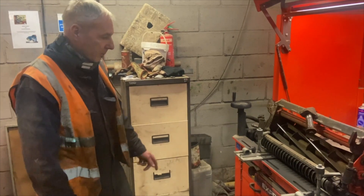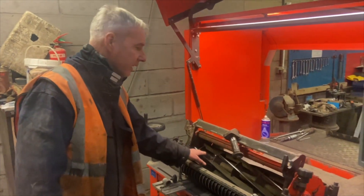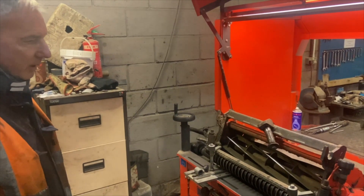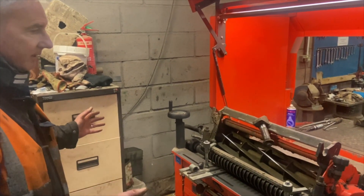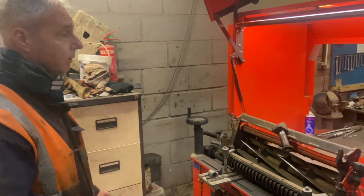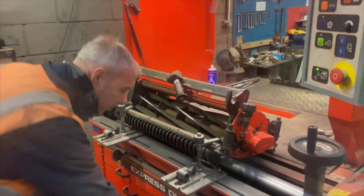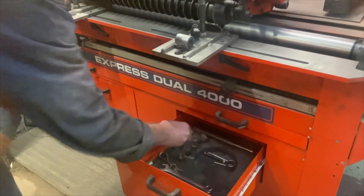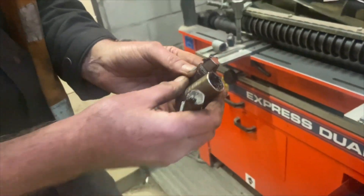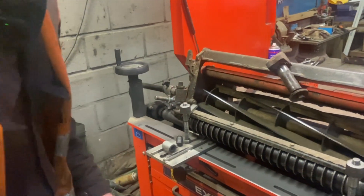This one's the Express Dual 4,000 and this one grinds the cylinders. It's a pretty straightforward machine to use — more straightforward than others on the market. You don't have to strip the cylinders out, which you do on some grinders. All you have to do on this is just release the bottom block with the bottom blade on and then it just fits on. We have different fittings for different cylinders — different ends — and obviously you change over depending on which one you're using. These are Jacobson 405s at the moment.